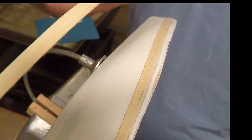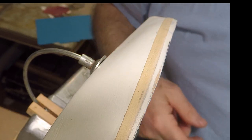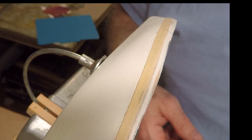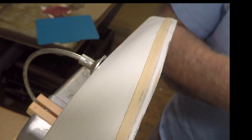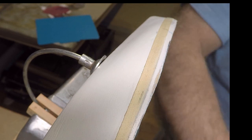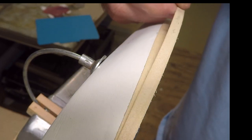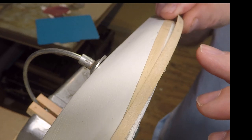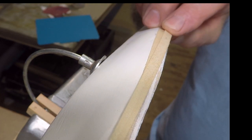During the cutting or carving of the hull, it's possible, indeed likely, you'll wander off the marked shear line. If there are only one or two spots with small discrepancies, it's probably best if that's not corrected until the shear strakes and the rails are applied, and you'll see why a little bit later. The shear strake will be the determining factor in what the boat's profile will look like, provided you've measured, cut, and installed the planks correctly.